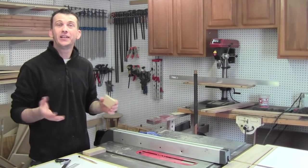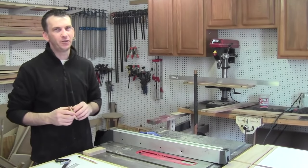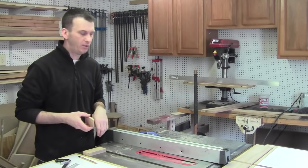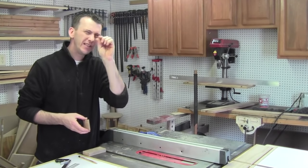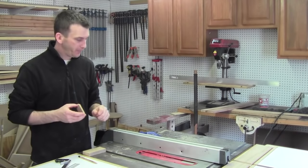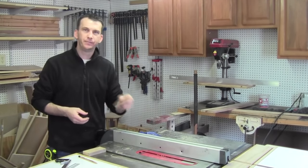Let me clarify: each side piece was cut to three inches in length, and two and a quarter inches tall. Over at the table saw, I've got the fence and blade set up to cut the grooves in the bottom of each side piece that will accept the bottom panel. The blade height is set to cut a three-sixteenths-of-an-inch deep groove, about an eighth of an inch wide — close to the width of a blade kerf. The fence is set so that groove is located a quarter inch in from the bottom of each piece.